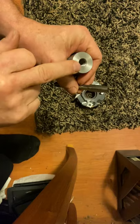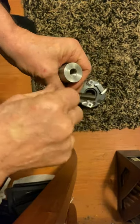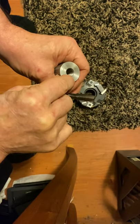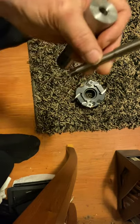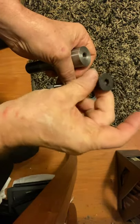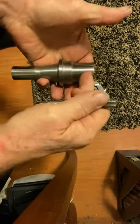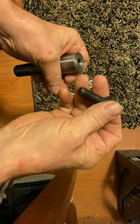The problem with this type of connection is there is no safety if we run this in reverse — we could have a problem with that. Some manufacturers like Felder might put a little pin on either side. But for about $7, you can buy a left-hand threaded nut — these are like five bucks — and I can now manufacture these and use them for left-hand operation.